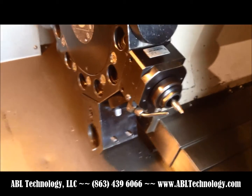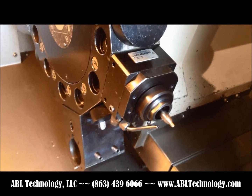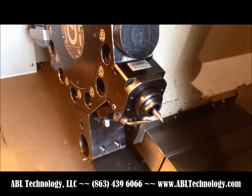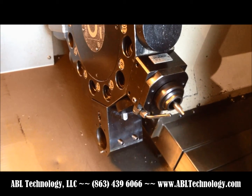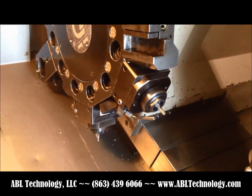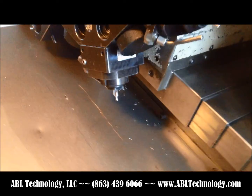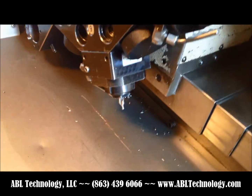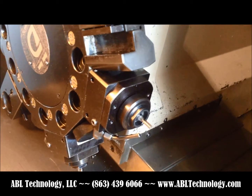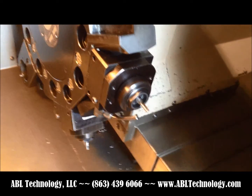Same tool, now at 2,500 RPM. Switching to tool position 11 — this is a live drill tool. Previously at position 9, now at position 11 with another live drill tool, a radial tool, running at 750 RPM.